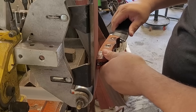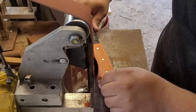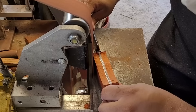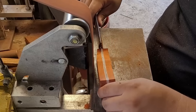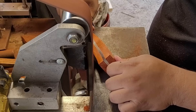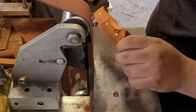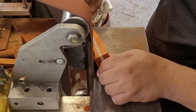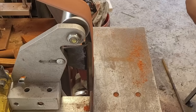Here I'm just going to clean off all the epoxy all the way around the knife. A good rule of thumb whenever you're grinding epoxy off — if you see sparks, it's pretty clean. Here I'm just going to start slowly grinding in my shape for the handle; in this case I'm going to do a bit of a coke bottle shape, using the pin as reference so I can get two even sides. Now I'm working in that little finger groove area — I don't know what it's called, but normally I use a small wheel to do that. This time I tried it with just the edge of the platen and it comes out kind of ugly, but it gets the job done — I probably won't do it like that again though, since it causes a lot more hand sanding down the line.